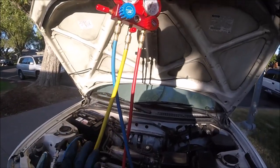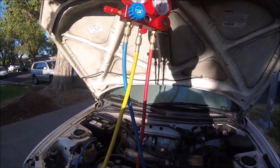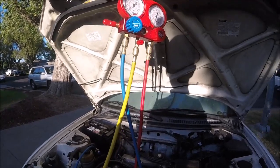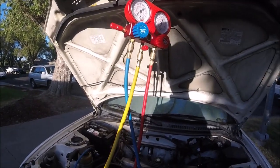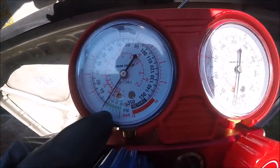You're going to do this vacuum to check if you have a leak. We'll pull vacuum, then hold the vacuum, and if it holds that pressure that means there's no leak in the system. You also need to do a vacuum on your system if you're going to recharge it and all of your refrigerant is out, because you can't have any air in the system.